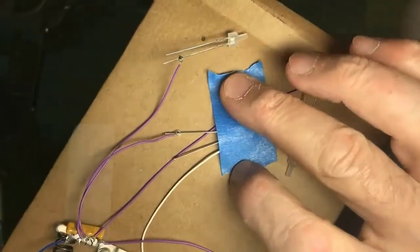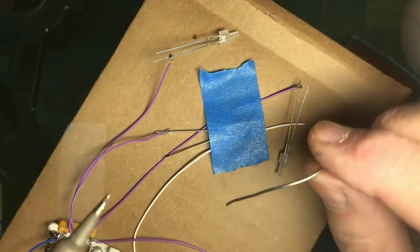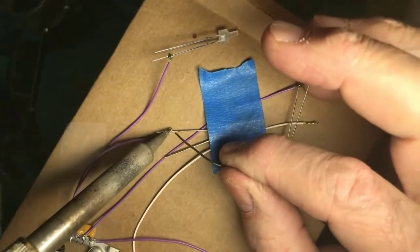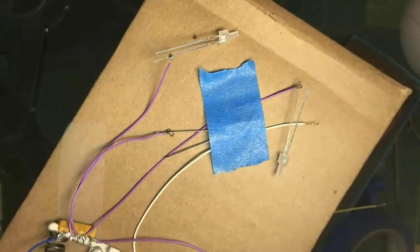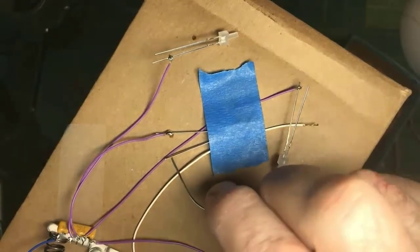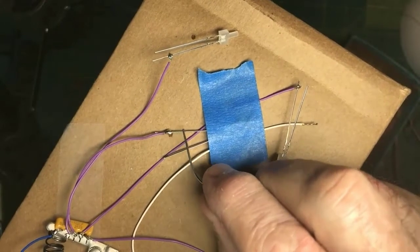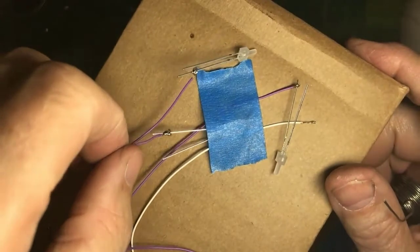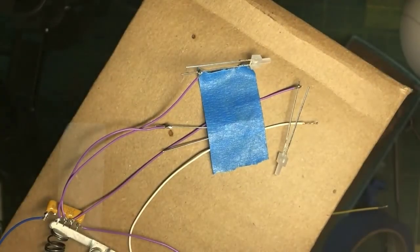All right, everything's held still, getting closer here. Wipe the tip clean, fresh solder, apply it to the work, and solder. And again, I'm noticing as I look at this, it's bright and shiny. That's what we want to see there. It doesn't show up, I'm afraid, real well for you guys. I'm exceeding the limits of what I have in terms of a camera.